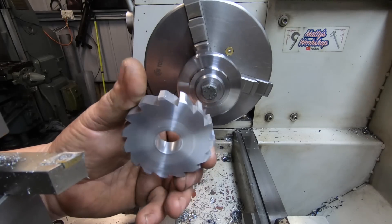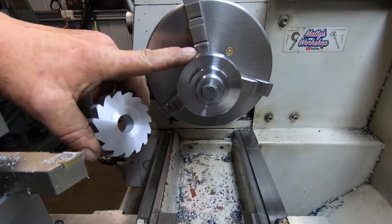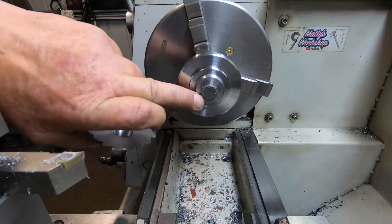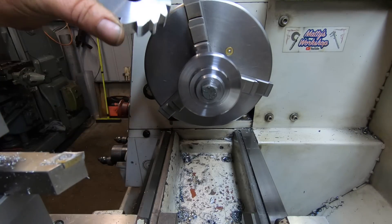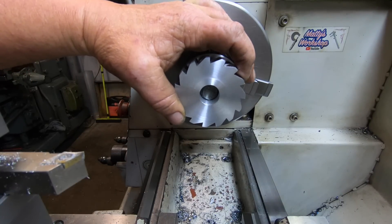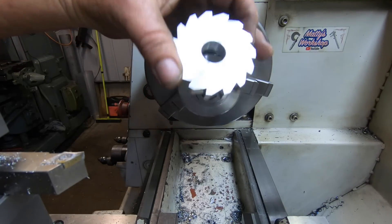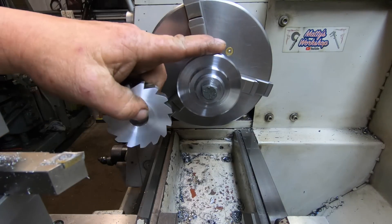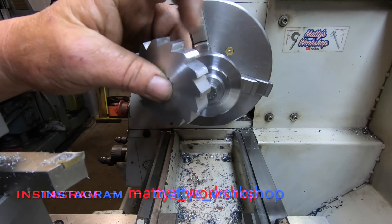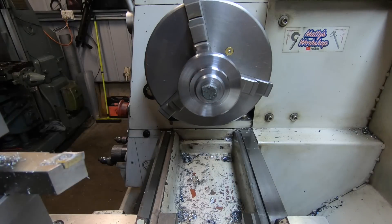I've made one out of aluminium off camera to see if I can do it. I've made a blank up — just a straight turn, 65mm diameter with a 40mm boss on it. It's just a washer holding it on a mandrel so I can go straight in the rotary table. I've done it with a 60 degree dovetail cutter and a 60 degree countersink — those are the two tools I've used. If you follow me on Instagram you'll see a picture of it with the aluminium gear on it, and it matches up fine, so I think it'll be alright.